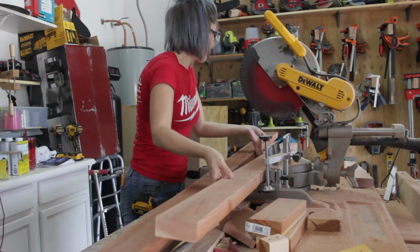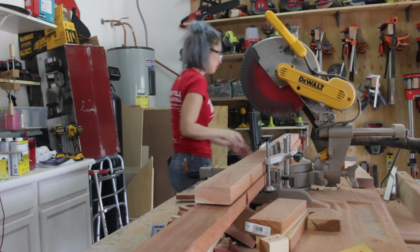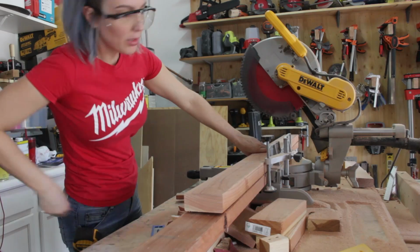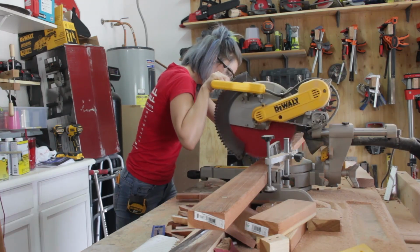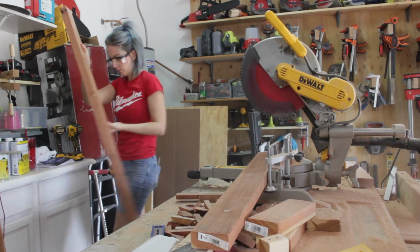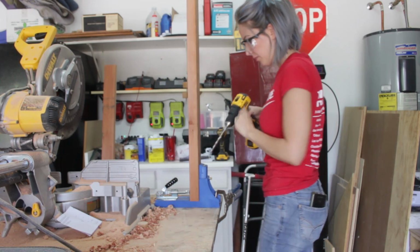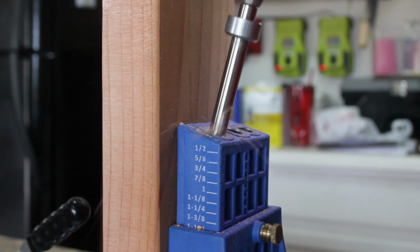While my finish dried in the shade, I started work on the storage trundle. Basically, I wanted to create a little sled that would slide under the seat and hold additional cushions. To save space, the 2x4 frame needed to be oriented horizontally. The best way to hold the boards together in that arrangement was using more pocket holes.